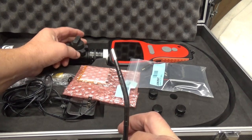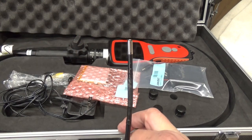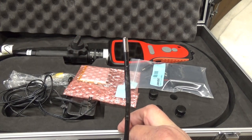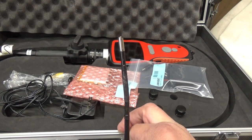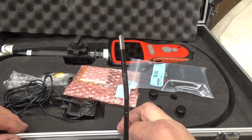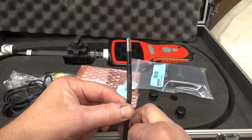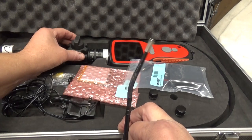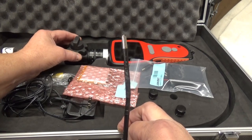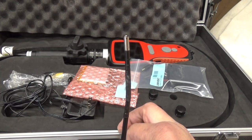You can look to the left, to the right, up, down — whatever you want. It's sort of neat when you're dealing with malfunctions in locks, and sometimes you don't know exactly where things are or what the cause is for that malfunction. This allows you to put a hole in there, stick the probe in, and just look around left, right, up, down — instead of having to drill a bunch of exploratory holes.